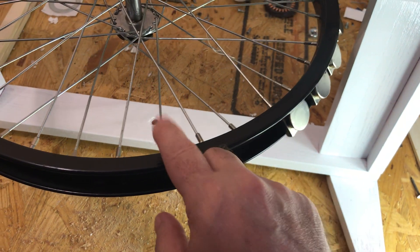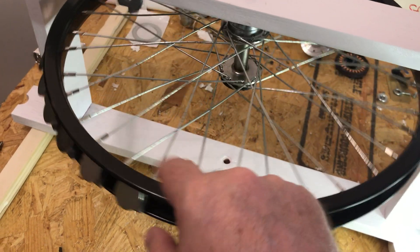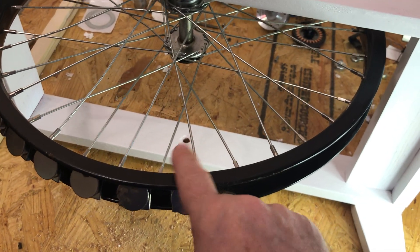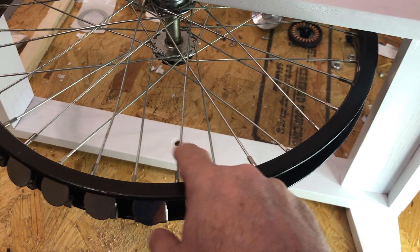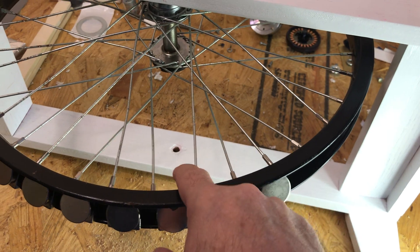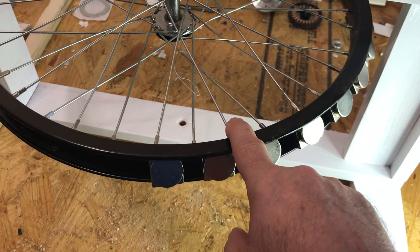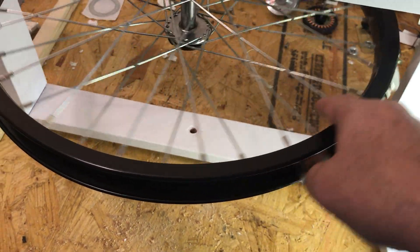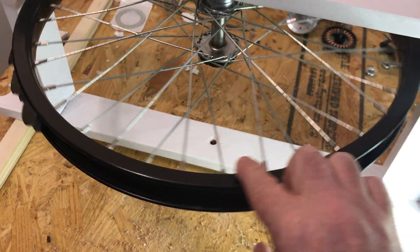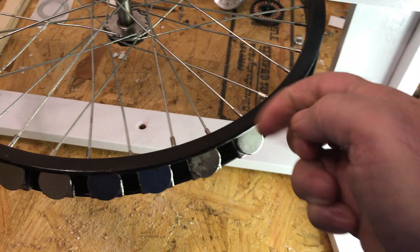And when to flip it back after the repulsion mode comes to an end — right here. At this point it would flip back to attraction mode, then as it passes it'll hit this spoke. It doesn't really make a difference which spoke we use, as long as we do it before the last stator. So it would be flipped to repulsion mode here, and then flipped back to attraction mode just before it gets too close. That's what I'm thinking, but it gets a little complicated.